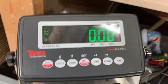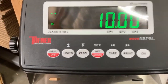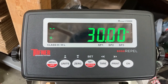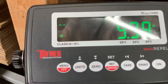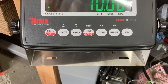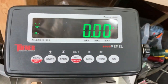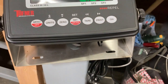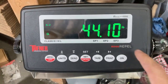0.00. So I can start adding my 10-pound weights. Let's see — 10 pounds, plus or minus 0.02 is fine. I'm adding 30 pounds total — adding 20, but now it's 30 pounds. Very stable. Not fluctuating. Very good. More importantly, make sure your feet are all leveled and the floor is not bumping. I'm going to add a 20 kg weight — that's 44.0809 pounds. I might just round up to 44.10. You can see 44.10.